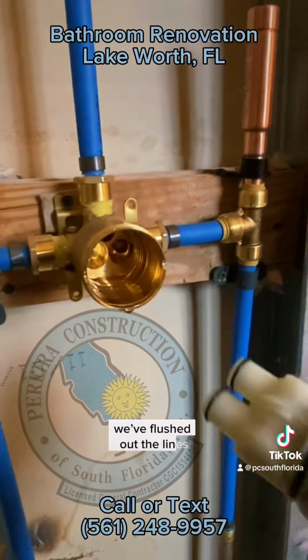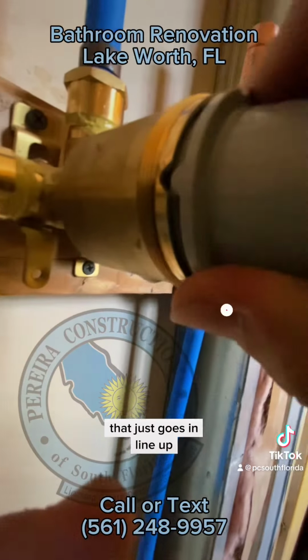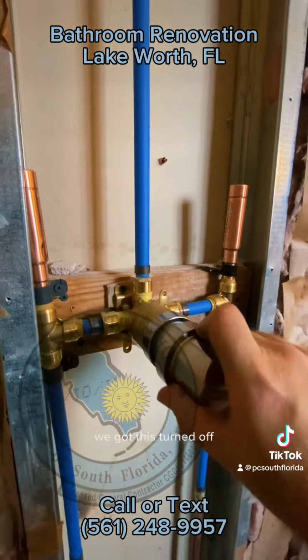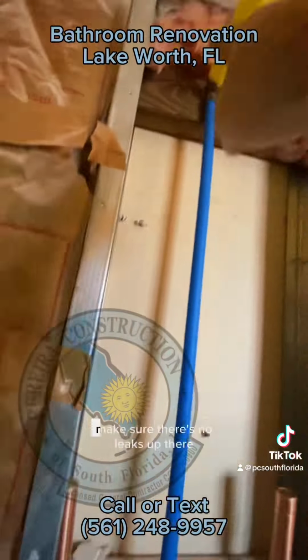We flushed out the lines. Now we're going to put the cartridge in. That just goes in and up. Go turn it back on, Christian. All right, water's coming on. We got this turned off so we can just check these connections. And then we'll open this, make sure there's no leaks up there.